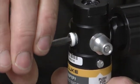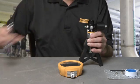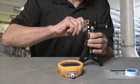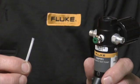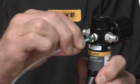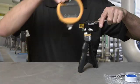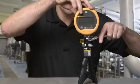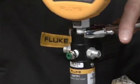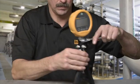Remove the hex plug, then install the push fit connector. The second push fit connector is for connection to the device to be tested. The push fit connector fitting connects to the translucent hose provided with the kit. When connecting the Fluke 700 G series precision test gauges to a pneumatic test pump, always use a backup wrench on the pump so the pump does not get damaged.